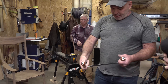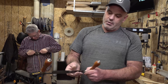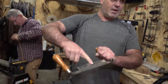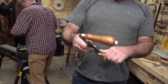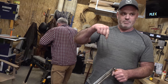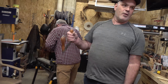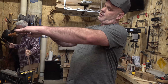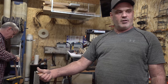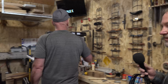This is what they call a draw knife. There are all different kinds — you'll notice it's got a bevel. Some of these tools are used with the bevel facing up and some with the bevel facing down. The way you can tell is how the handles line up with the blade. If the handles line up straight with the blade, that's a bevel-down tool — so you'd use it with the bevel part facing down into the work. That's counterintuitive to what you might expect.